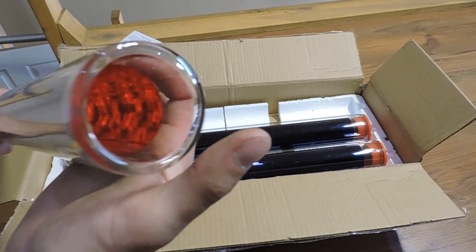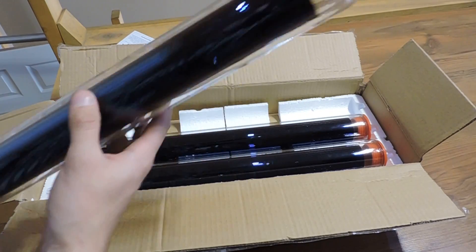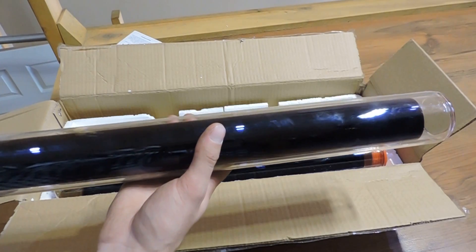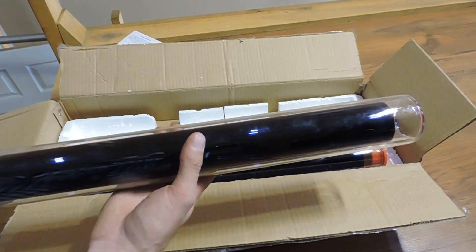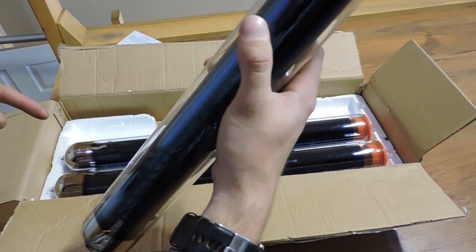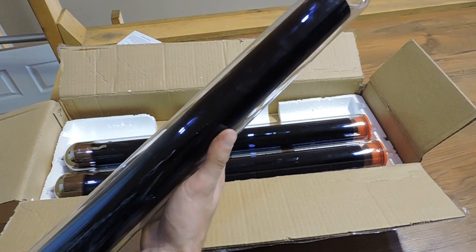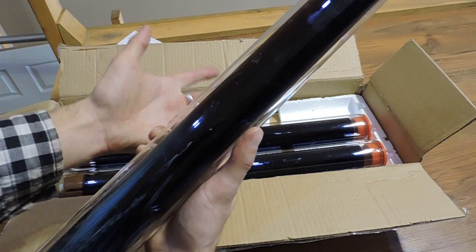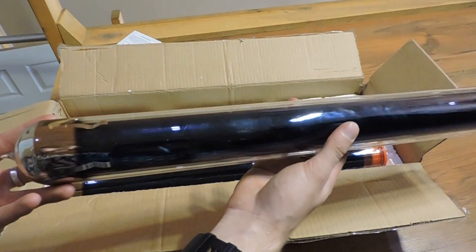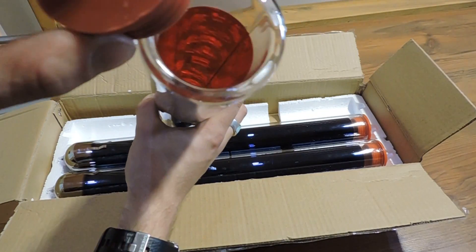Essentially what you want to do is stick your contents in the inside, put it out in the sun, and it will produce heat. Depending on where you live, the sunlight angle is a bit different. In Canada it's quite drastically different between summertime and wintertime — in wintertime the sun is lower in the sky and you have to be quite high-angled, while in the summertime you can even be low. If you want a faster reaction time, add a reflector behind it and you get 30% more output. So that's our 0.5-meter tubes — this is the newer product that we have. Thanks for watching.